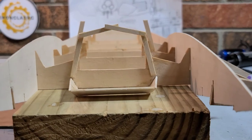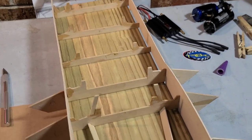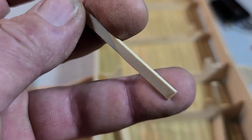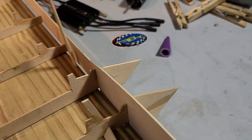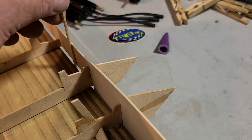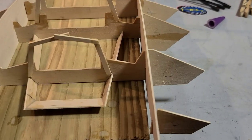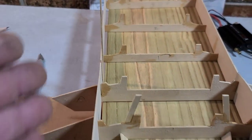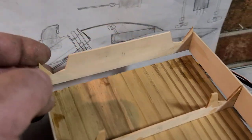You can make the back of it wider depending on what kind of boat hull you have. I went basic and didn't cut mine to fit in the tunnel tight — I left it one sixteenth of an inch short so I can put these sticks in there on each side. If I'm setting this side up I can put these sticks in there and make sure my stringers are straight up and down, because I cut a 90 on the sides.